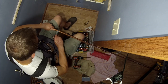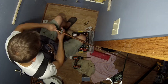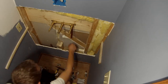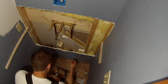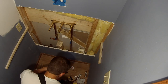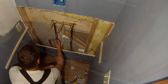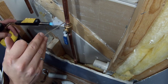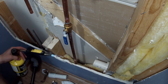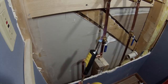That brings me to tip number three: when you're doing plumbing work, dry fitting everything together first makes it a lot easier and can save you a lot of time. Cut out all the pieces, put everything together dry without sweating any of the pipes so that you can make sure everything is fitting and get it all in place, and then come back and sweat the pipes. I learned the hard way on previous projects by sweating each section as I went, which made it really tricky to fit the last pieces in, and if the measurement was slightly off, made it a lot harder to adjust.